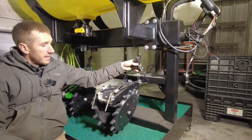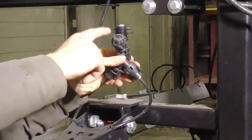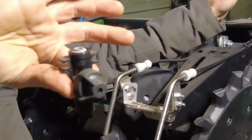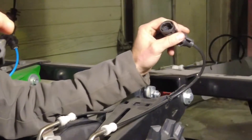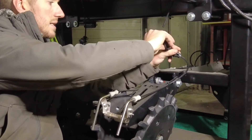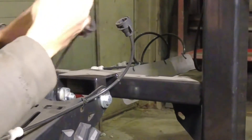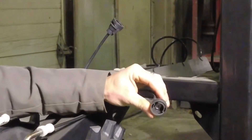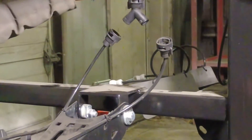How we like to do it is use an apparatus like this. I really like this T-jet Y for a couple of reasons. It's got our check valve in the top — right here is our check valve — that is what's going to lock the lines when we raise on the end. It's going to stop that product from leaking out the back. So it's got that built in the top, and then we've got our split right here.